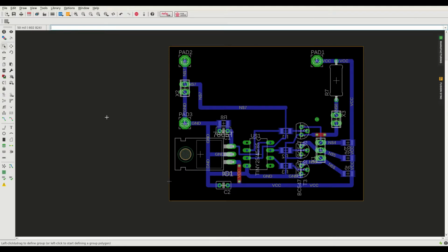So, now after we've done the schematic, let's just go over the board real quick. This is not going to take long. There's not much on here. Yeah, the controller is here. It's a single-sided board. I always do single-sided for prototyping, and really something as simple as that. If you need two sides to do that, you're not doing it right. Honestly. Also, two jumper links, that's just fine.